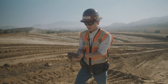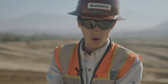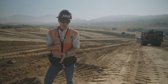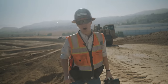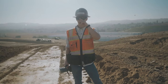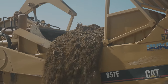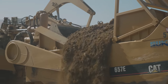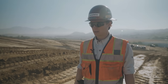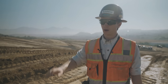Next, you have the right soil conditions - this stuff is so soft, no ripping, no blasting, no rock. It's just nice dirt. And there's not a lot of rain, so you don't have these things slipping, and no winters, so you can run all year round. Scrapers like that nice, soft, dry dirt - they don't like water, they don't like anything hard. Southern California is just about unbeatable, and that's why just about every earth-moving contractor out here runs these 657s.